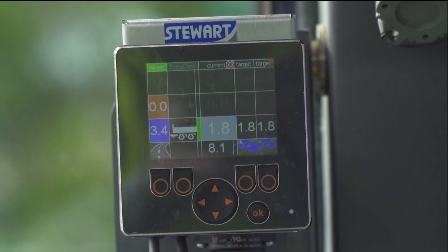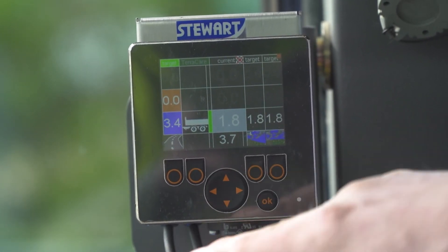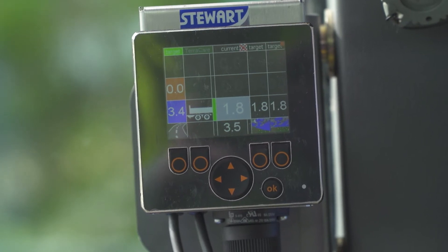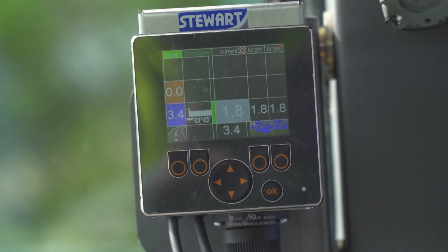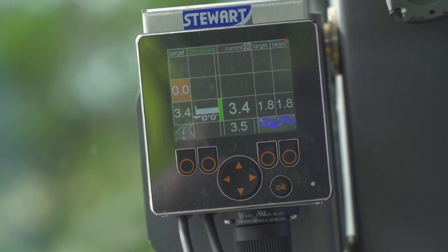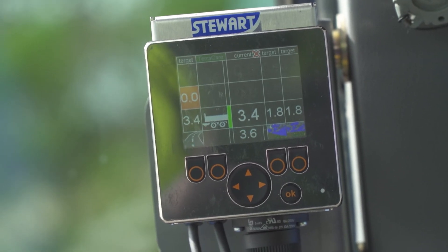Here we are. We can see the supply pressure is changing — in the tires it is still showing 1.8 bar but the supply pressure is dropping down, so we know the air tanks are deflating and it will continue for another 15-20 seconds. Then it will stop, check the pressure, and re-inflate a little more if needed. If we've gone past 3.4 bar it will deflate back. First try lucky — it's 3.4 bar. Now we can safely drive on the road at 50 km/h because the tires are designed to cope with that load at 3.4 bar. And that's us done.